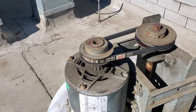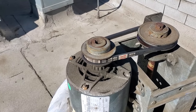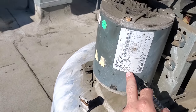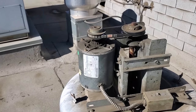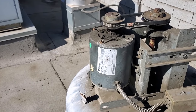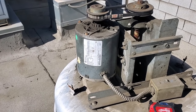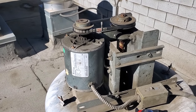This is a 3-inch pulley. I don't have any tools to do calculations, so I'm going to wing it — I'll probably pick up a 3.5 and a 4-inch pulley and see what we can get out of this thing. We had quite a bit of room in the motor — we're running 1-something amps and we're allowed to run 3.3 amps. What we need to know for this motor: voltage, RPM, amperage, frame, and pulley sizes. I'll show that all on the data tag.